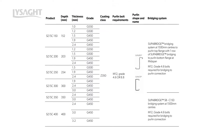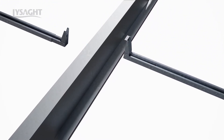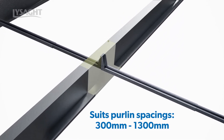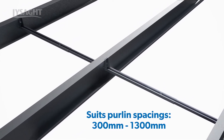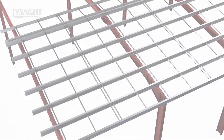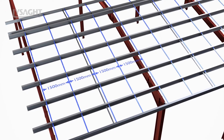The Lysart Superbridge system is suitable for use across the Lysart Superpurlin range from 150 to 400 mm Superpurlins, utilising standard gauge line punching and conventional purlin bolt connections. The adjustable Superbridge brackets are available in four sizes and two depths to cater for purlin spacing between 300 mm and 1300 mm. Whilst the system caters to a wide range of purlin spacings, the most efficient purlin spacing is 1300 mm. Superbridge sections are spaced at a maximum 1500 mm centres along the Superpurlin length.